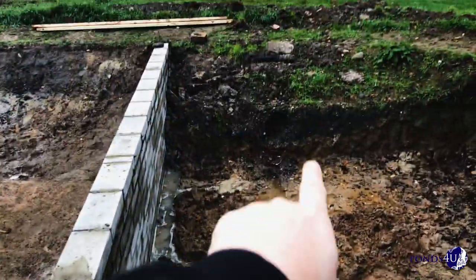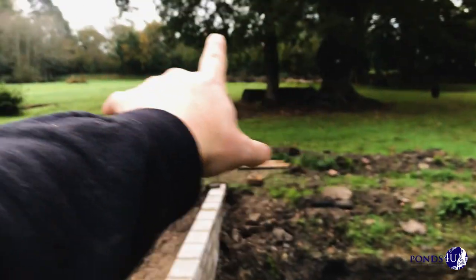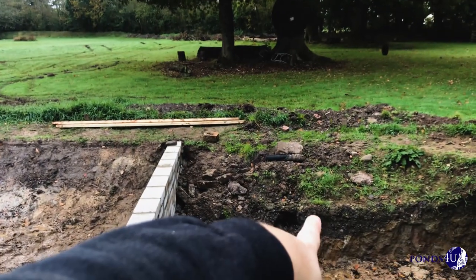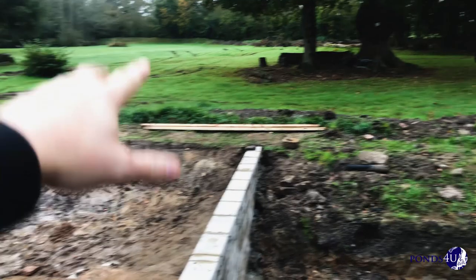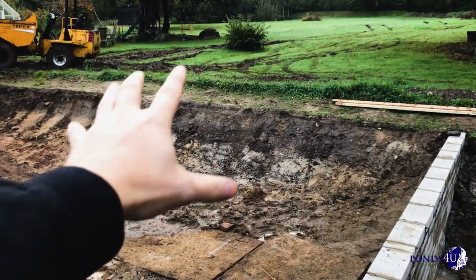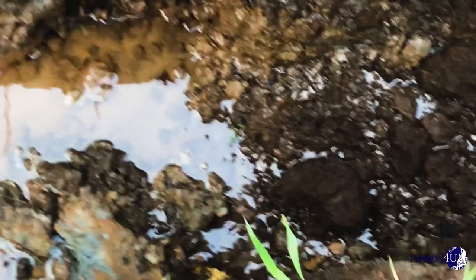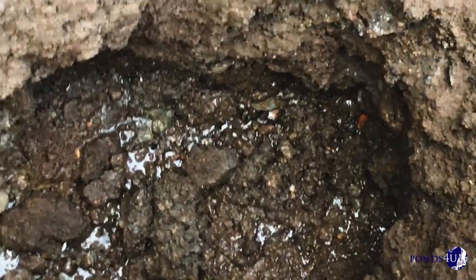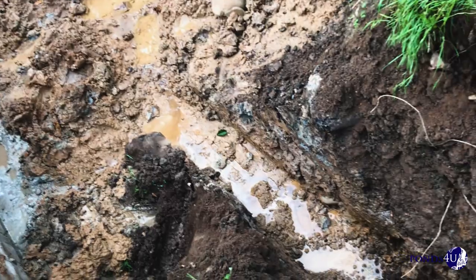You can see we've just got water. You can see the line of clay and then the rest of the soil. So all the water, even if it's not coming from the land drains, it's still working its way off that clay layer and coming in here — it's been a nightmare. You can see this one is running as well. There's the land drain, it's actually running that way too. So it must be another land drain coming in from the bank there.